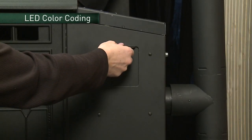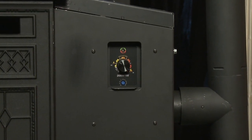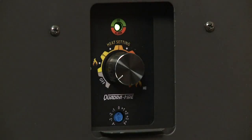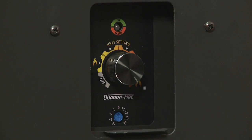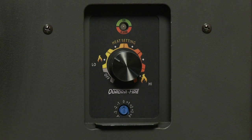The Mount Vernon E2 is equipped with a diagnostic indicator with a flashing LED light that communicates the status of the unit. Green flashing means it's operating normally. When the light shines steady, the unit is priming the feed tube — this lasts about two minutes. When the light flashes every two seconds, the unit is in standby mode. If the light flashes continuously, the unit is starting up or shutting down.